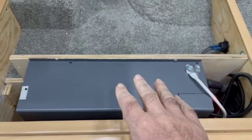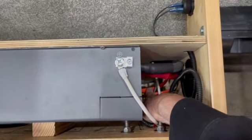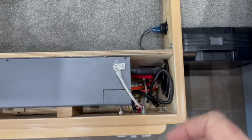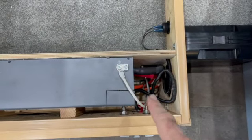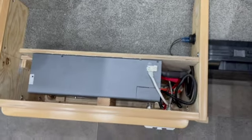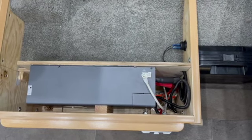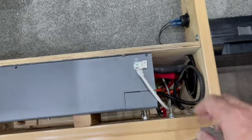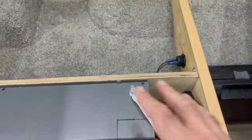The other thing I did, since this is a 3000 watt inverter, is you can see down here these orange wires. The 2000 watt inverter had a yellow AC cable. The yellow is actually a 12 gauge wire. So I increased the wire size to a 10 gauge to be able to handle 30 amps, so I could run the full 3000 watts of this inverter. I think more importantly, it makes it safe then to run the 150 amp charger. So that's a critical piece. If you're going to upgrade, you need to upgrade the wires as well. Fortunately, Pleasureway already had 4-aught cable for the DC power line, so I didn't have to upgrade that, just the AC wires to handle the current of this system.